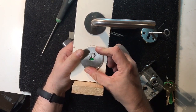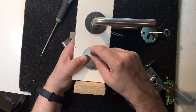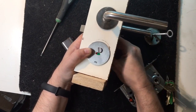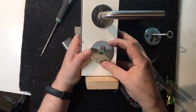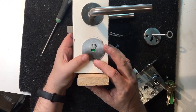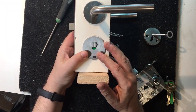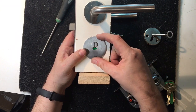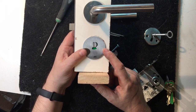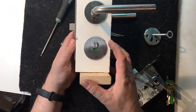If the kids are stuck in there and can't get out, you can just take a screwdriver and turn the screw head, and then you can lock and unlock as an emergency. I do prefer to install this one on toilet doors — it's a much better idea than just a basic key, because this way you can also see if the door is locked before you go over and pull the handle to find out if it's occupied or not.